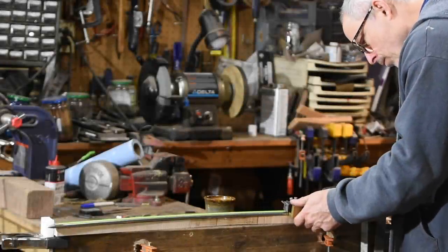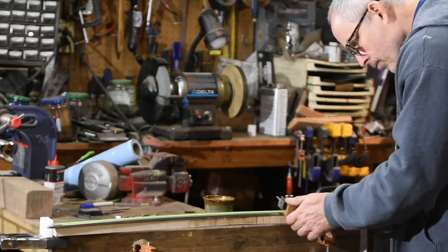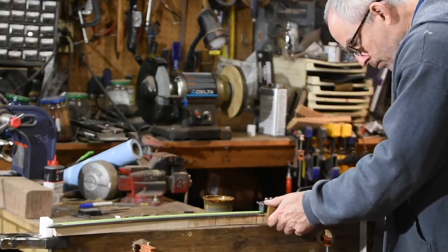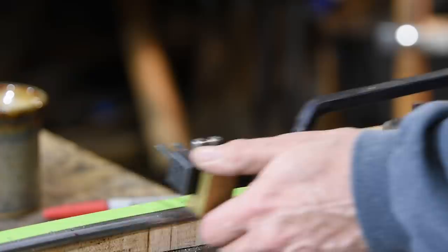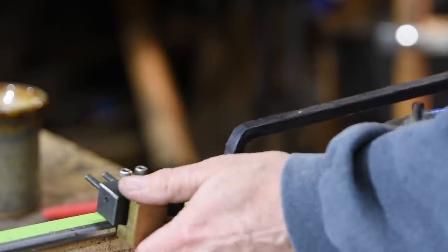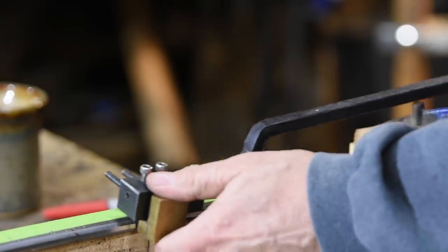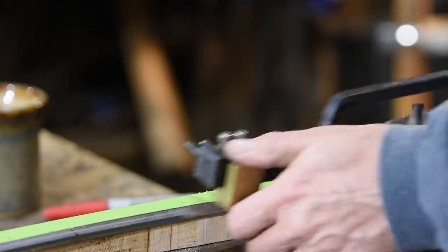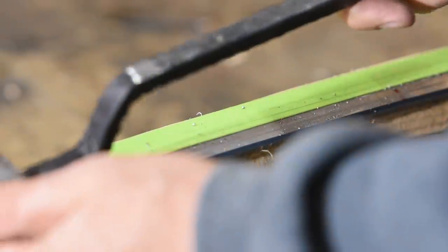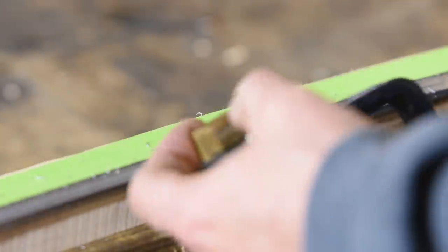Because the cutter tracks that back edge, the ends of each section won't be exactly centered on the shinogi. So eventually I'll be blending them together stage by stage to try and get them exactly centered. I'm just taking my time — I've got maybe 75 or 100 hours of labor invested in this sword already, so it's worth taking my time and avoiding screw-ups. Don't bully the cutter; just let it do the work with your hands supplying a little motion, a little stabilization, and a little weight so it won't jump the track.